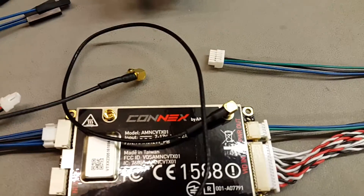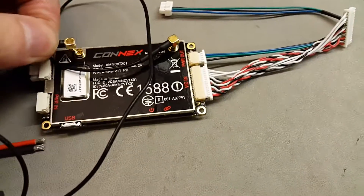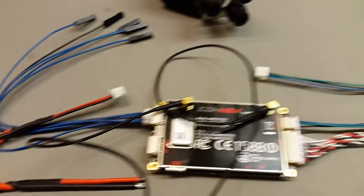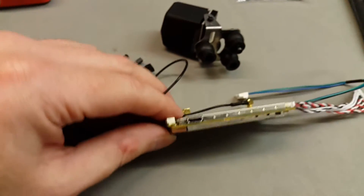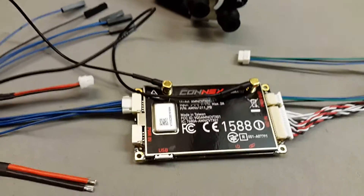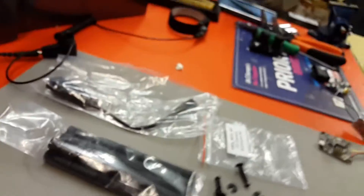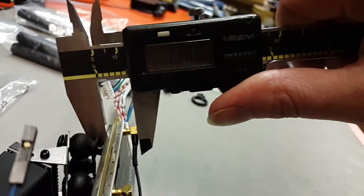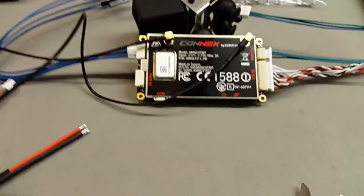It's got two antennas and they're clipping on the surface. I had to put one of these in and they are tough. All in all the unit is quite thin, but if you add these antennas on it you do need a fair bit of space. Let's get the calipers on it — you need 13.6 mm to clear the VTX and antenna clips.